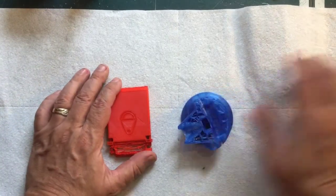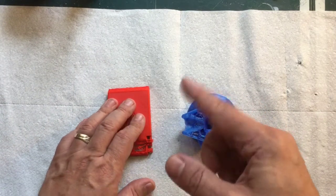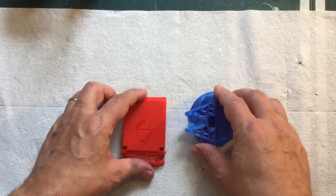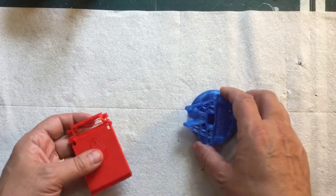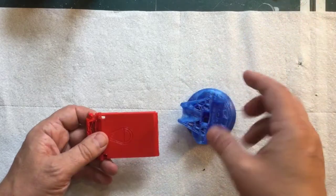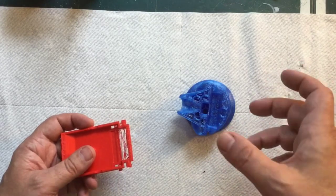Print shift is something I've been plagued with ever since I got my printer many years ago. I recently saw a video — I'll put a link in the description. A lot of people commenting on that video say they never get print shifting, which is great. But somebody else commented and said they only get print shift if a belt slips or a pulley slips because a set screw was loose.